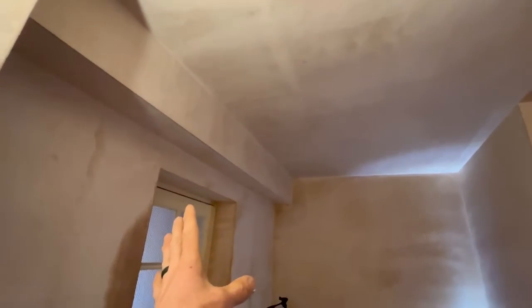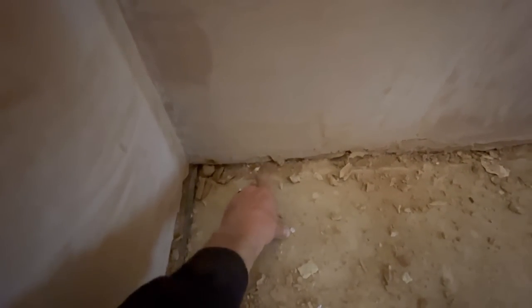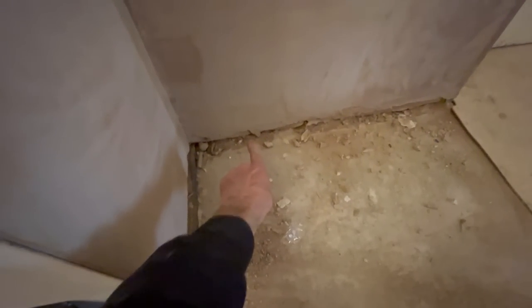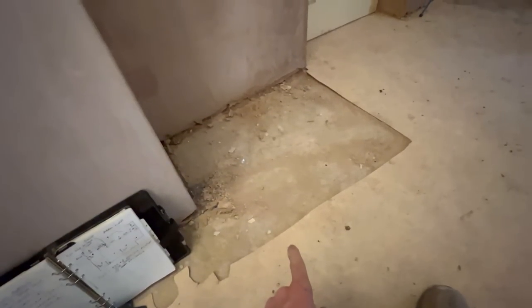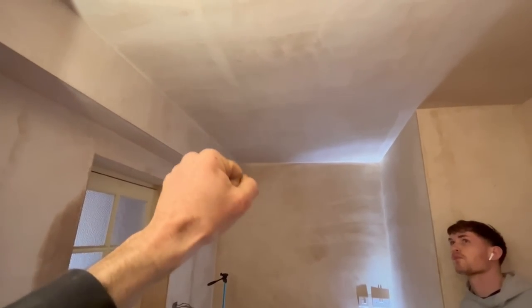Then when you come to this stage, if this has been dabbed, all you can do is, because it's going to have skirting board on it, put a little tiny notch in the bottom of the plasterboard and go back to the block work where you originally measured and put your mark on your floor to start for your first fix. So when you then use your laser to come back up and do what we're doing now, we know there isn't an issue with where your cables are going to be. Because like I said to Charlie, unfortunately plasterboarders might come in after, and if you've left your cables dangling, I'll just chuck them up, or I've seen some of them cut them off because there's too much cable. Unbelievably, I know, but they do it. That's what happens on site.